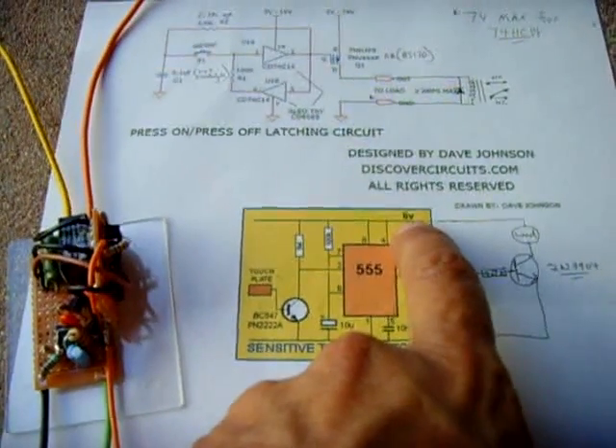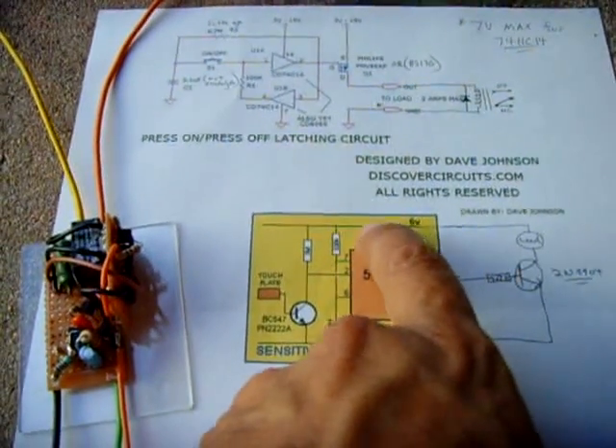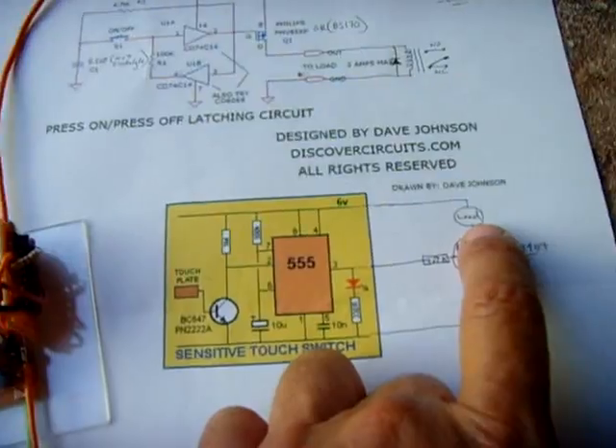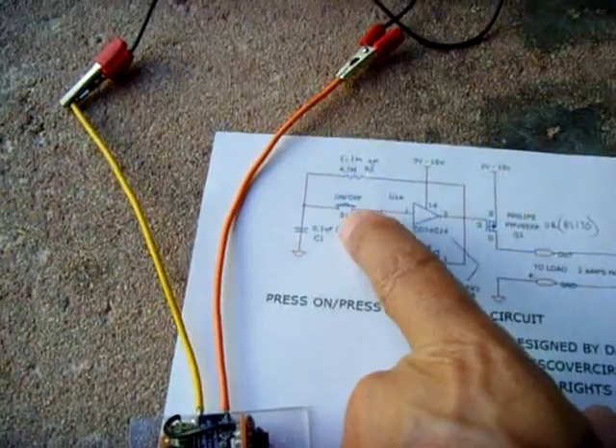When the circuit is running, this side of the resistor is going to be 12 volts and the other side will be around six and a half. That's how I handled that. The relay coil here opens and closes, and it's connected to this part of the latching circuit right here.